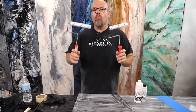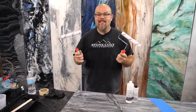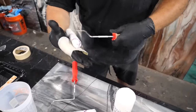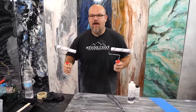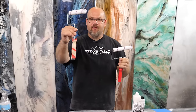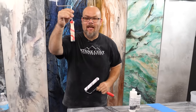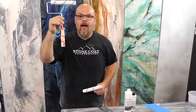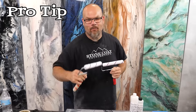I'm using a microfiber one-quarter inch nap roller. I like these rollers because they're easy to de-lint — you simply use some tape, roll it across the roller, and pull off any excess fibers. I also have two rollers here: one for wet and one for dry. I've marked the dry roller with a piece of tape, almost like a candy cane, so my eye knows which is which. That's a pro tip.